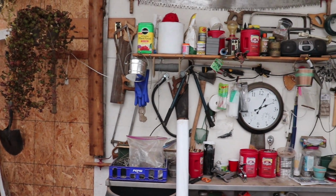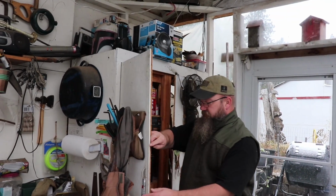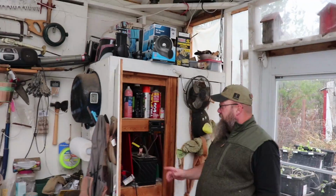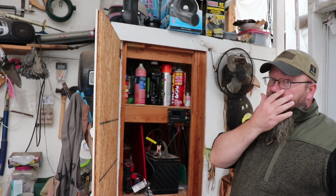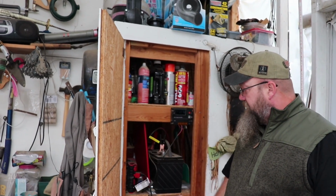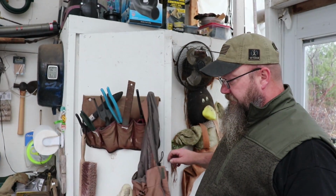we're redoing the solar on the outside. So all the old solar's coming down. This last spring I bought 400 watts of new solar going up on top. And I got a new charge controller here, which will hold up to 800 watts. We'll add an extra battery in. We've already got the new inverter, which is here, but all of that stuff will be put a little bit differently in there. And like I said, we'll probably get you a video on that too, to show you how we process all that. Anything else? Nope, I think that covered your punch list.